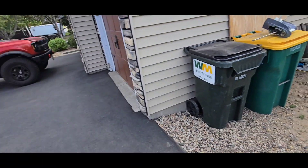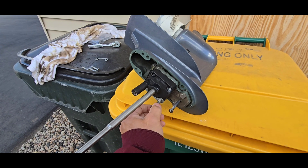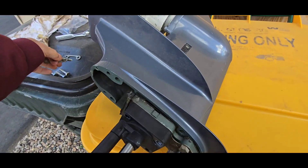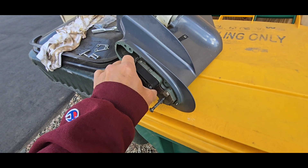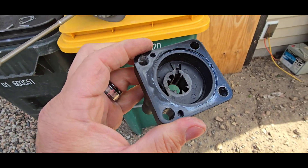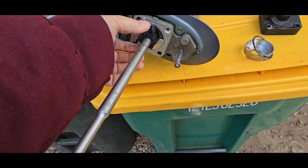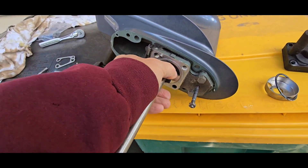Excuse my one-handed camera work. The bolts all come out, and these brackets — you don't want to lose those. Take that off, then this whole piece will just slide right off the shaft. And then this piece will come off too. That's the new housing — we have a new gasket. And look at that — here is the old impeller. You can obviously see why it wasn't pumping water anymore.